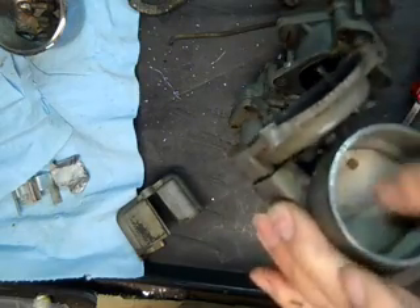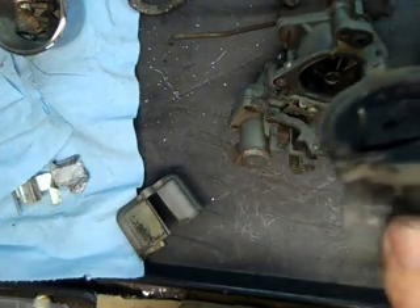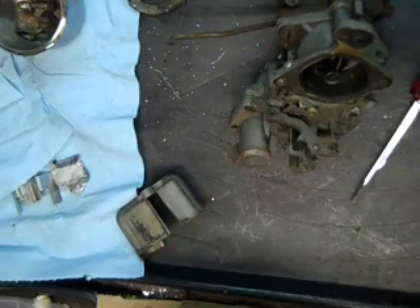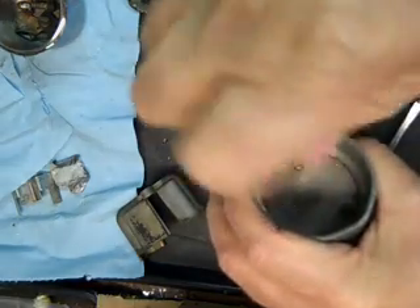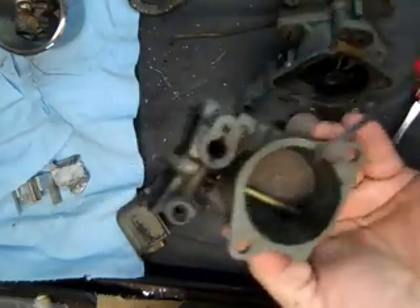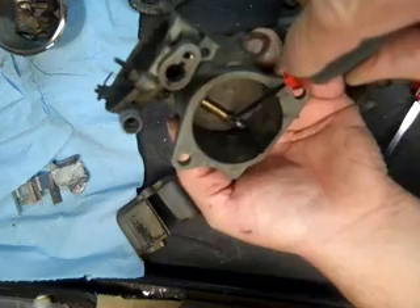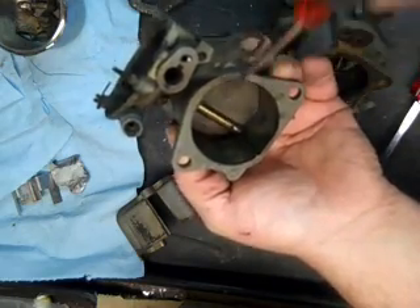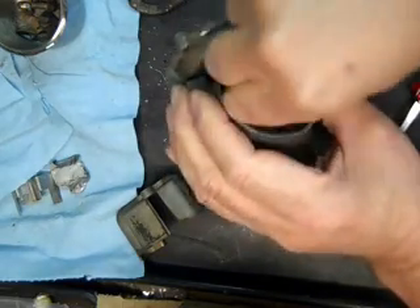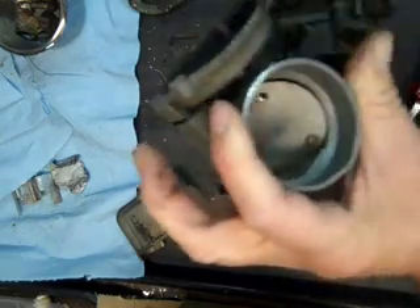To get the switch off you have to take the plate off, which I always do. Now if these screws don't come right out, get your Dremel tool and grind off the threads flush with the rod and then they'll usually come right out. You don't want to bust them if you can help it — then you've got to drill and tap. And they do break pretty easy.